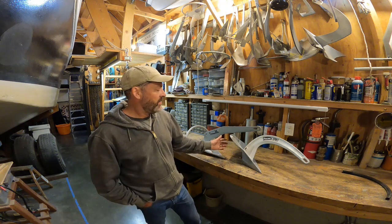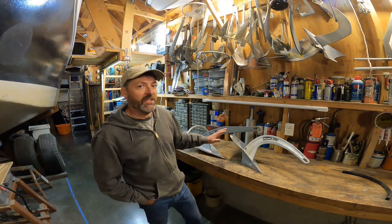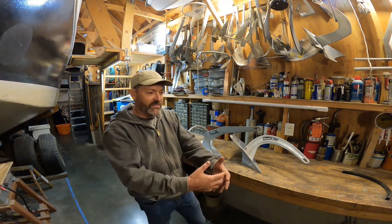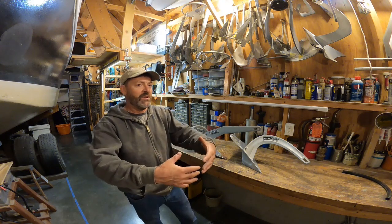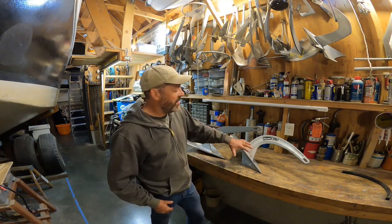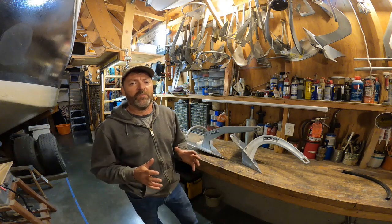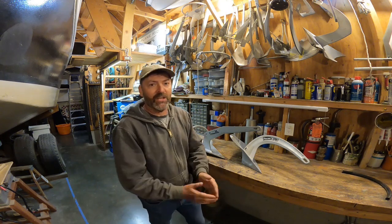If there was any doubt as to whether a sharp leading edge shank could produce a meaningful performance increase, I think I've put that to bed. It's not the case for all seabeds — for seabeds that lack structure or cohesiveness, seabeds that can just flow around structures such as really soft mud or really clean pure sand, it probably doesn't matter very much. But for seabeds that do have structure or that can clump or clog an anchor, there's no doubt it makes a difference. Another type where it probably helps is really hard, crusty sand — a knife-like structure should be able to cut through that much more readily.